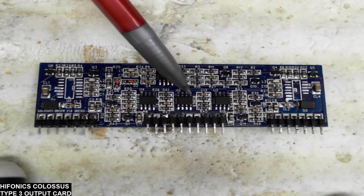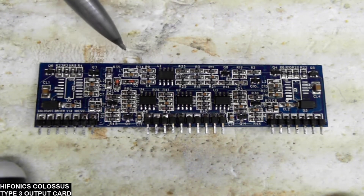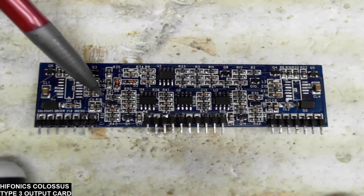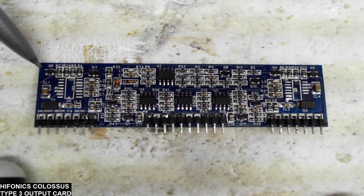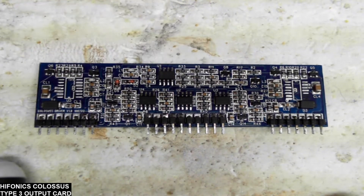So the 072 has got your input coming in, converting it and passing it to the 211. The 211 turns it into a square wave going into your 1A and 2A transistors, and then heading off to your 2D transistors going to pin 1. Pretty normal, except they use a dual 211 or 311. That's just a general breakdown of the basic layout and operation of this driver board.